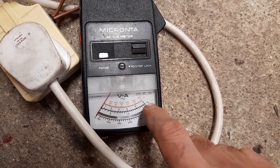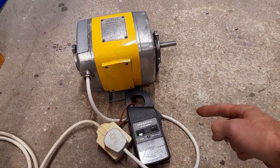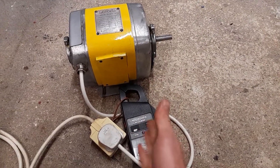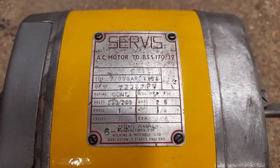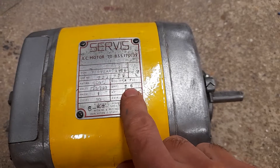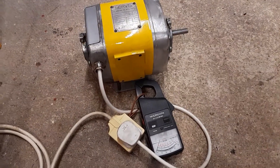The clamp meter is currently set to the 6-amp scale, so looking along this scale — one, two, three, four, five, six amps. Initially the needle is going to deflect quite a bit because there's going to be a large inrush current since it's stalled — that's the stall current — and then it will settle down to something around about two amps. The nameplate says two point six amps full load current, so we're not under mechanical load and I'm expecting something roughly about two amps.